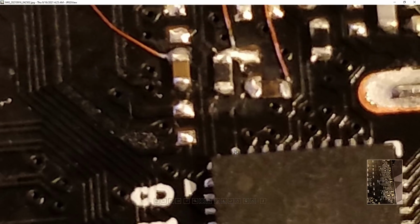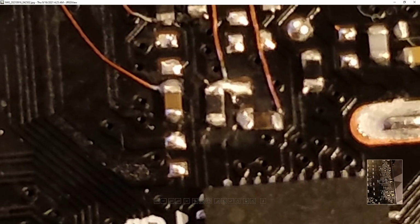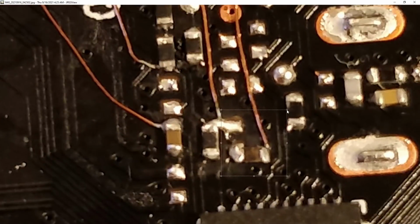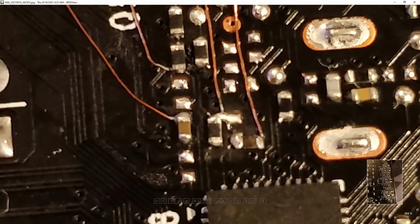So this pin connects to this resistor. I've put that resistor at a 90-degree angle because there was a bunch of empty space in this area, all this empty space for activities like 90-degree resistor rotations. If there wasn't empty space right here and we had a bunch of SMD components, I would have just tombstoned it, with the resistor sticking straight up off of the board. Then we attach a wire to it, and now we have our manual connection to ref ADJ. And then we have another connection over here with another wire. And this is very simple.